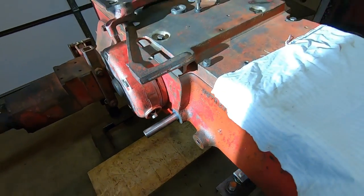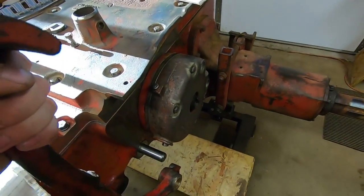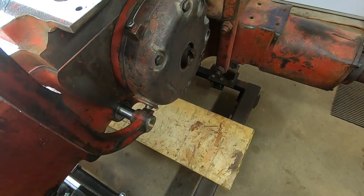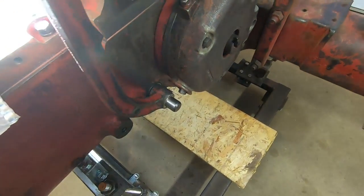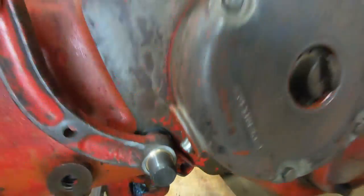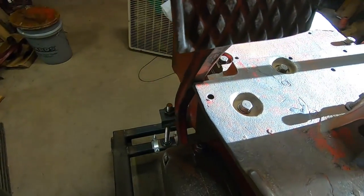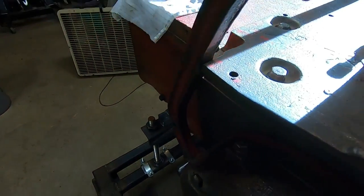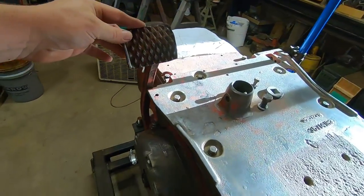There we are. Now, just to wrap the video, let's test fit this clutch pedal on there, make sure everything still seems like it's where it needs to be. So, again, doing this one-handed because I have to hold the camera, get out of that glare. Our travel limiter stop down here looks like it's hitting the same witness mark as before. Check up here at the top cover, lining in really well with the edge of that. So, get her on this axle here.